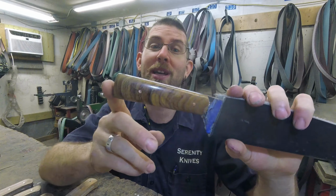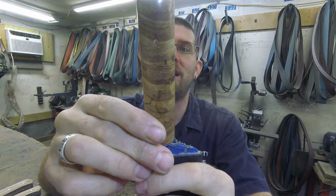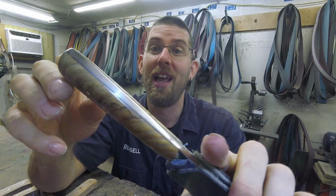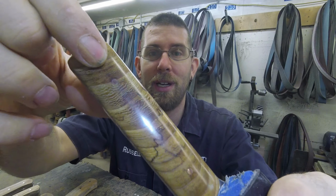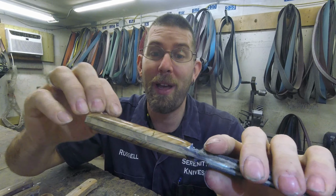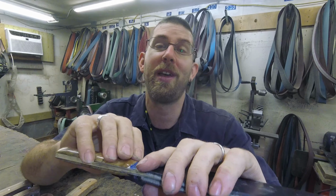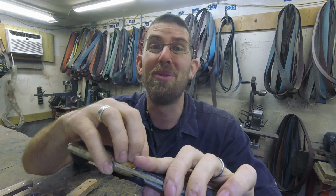What I will be working on today, I got this one re-hand sanded. So the issue with this thing was Yake had it hand sanded and buffed it. And because it's cross-cut, you see all these little spots in there. That got completely full of green compound, and I couldn't get it out by buffing, and I couldn't get it out with WD-40, which usually breaks down the compound. It was really in there.